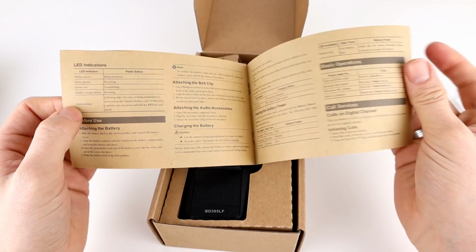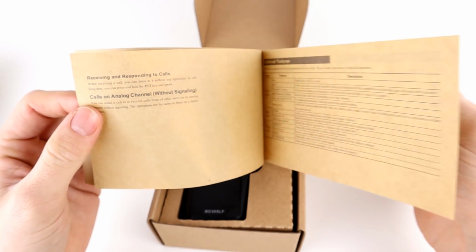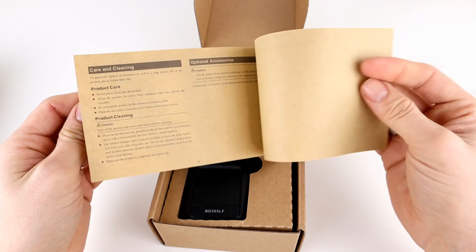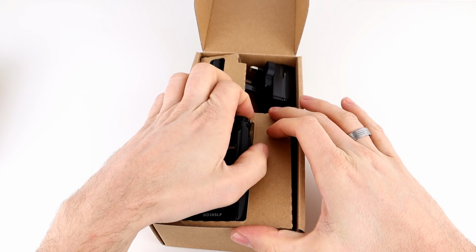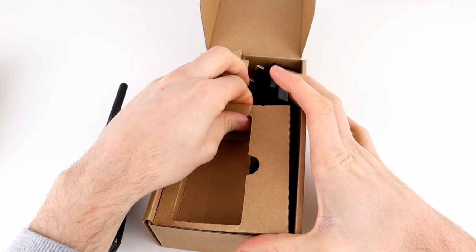And then for the analog features, you can take the squelch off, you can set the squelch level, and you can monitor, so that allows you to receive weaker signals, basically momentarily taking the squelch off. And of course it's got CTCSS and DCS tones in there. So it does pack quite a punch for PMR 446, with it being a dual mode radio for analog and DMR.